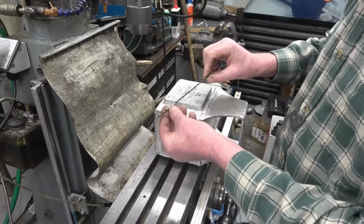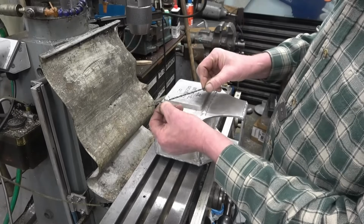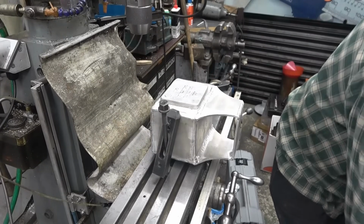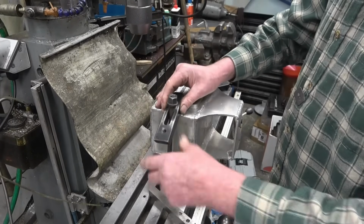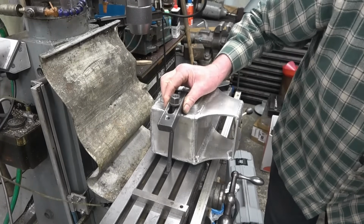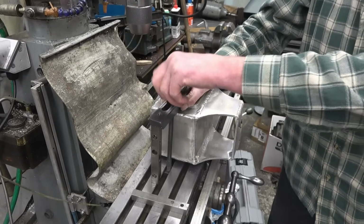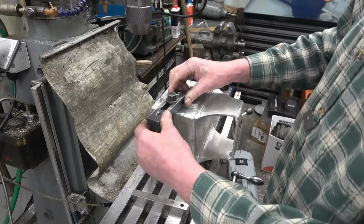I've got quite a few of these long drills. They come in very handy. Obviously we only use them for the particular use they're made for, because they are quite expensive. I need some nice long packing pieces to go under there. Well, it looks like it should do the job quite reasonably. Doesn't need a lot, it just needs not to move basically when I drill it.